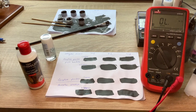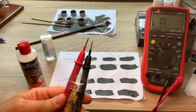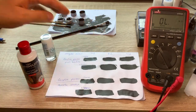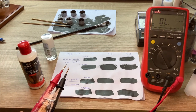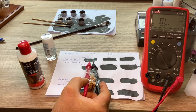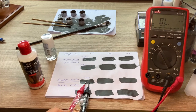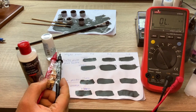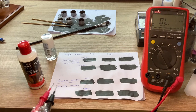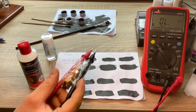Alright, it's the moment of truth — we are going to measure the resistance of these conductive paints. I put the probes of the multimeter approximately one centimeter away from each other. These two lines are made with nail hardener, these two lines are made with acrylic varnish — in both cases we use graphite powder. First we measure the resistance: it's very large. So if we use 10% graphite powder, either with nail hardener or with acrylic varnish, we get resistances that are really high — more than hundreds of mega ohms.